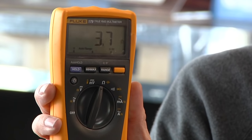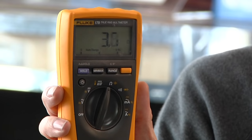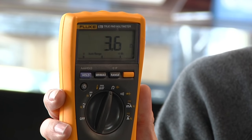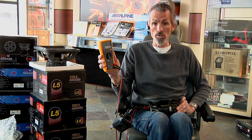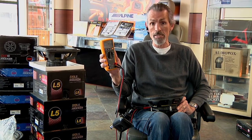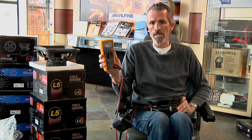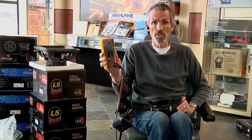Jumping all over the place doesn't mean deviating from 3 to 5 or something like that. What you want to look for are deviations where, say, it was reading 2 ohms and all of a sudden it's reading 15, then 26, then 3, then 7. If you see it deviating like that, that's a clear indication that more than likely the subwoofer is blown.